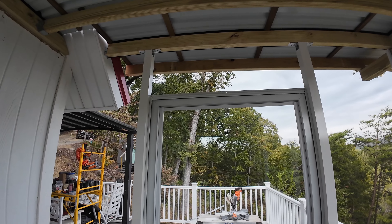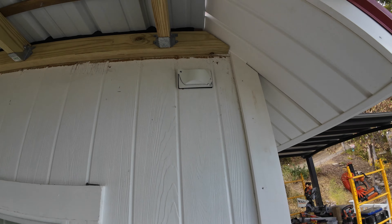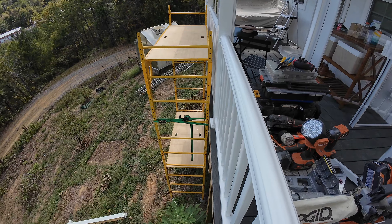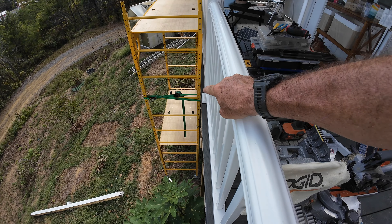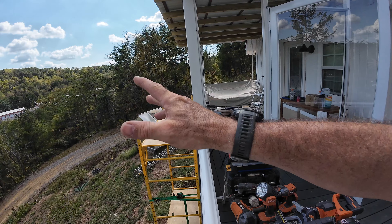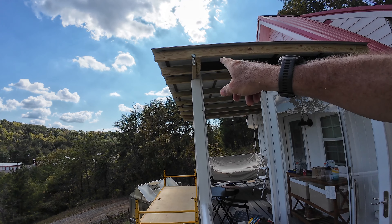Quick update - I took off this electric outlet, which is a ground fault interrupter, snaked a wire up there and added an outlet up there off the load side so we could plug in our lights. John Pro Cut back out here on the never-ending deck job - you can see I got my screen track up there in black, so I need to do that on the outside edges too. I got myself some leveler jacks for my scaffolding - two sets of scaffolding are up here and strapped to the deck, everything is nice and solid.